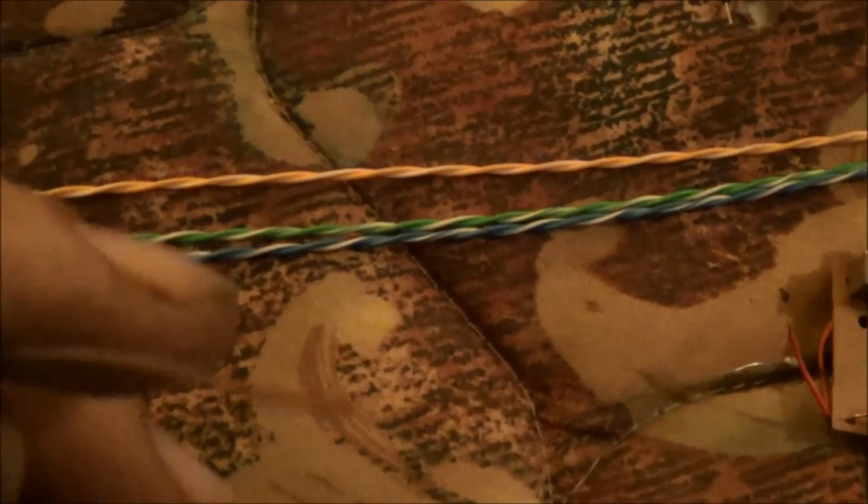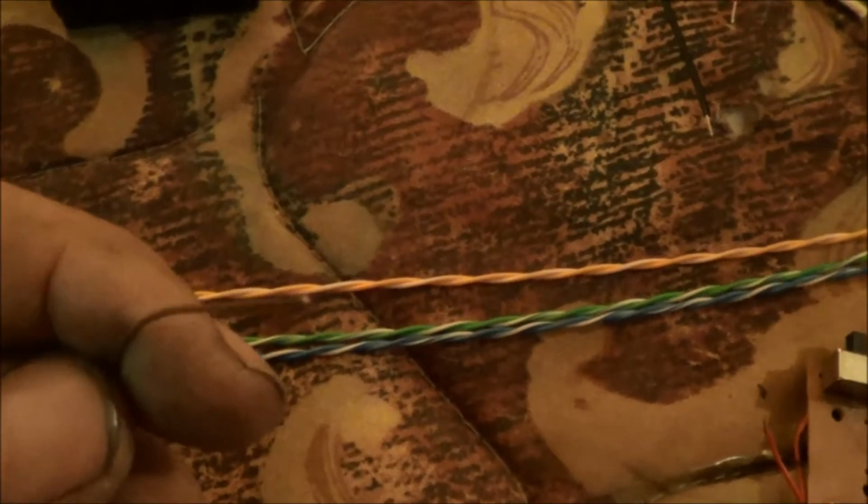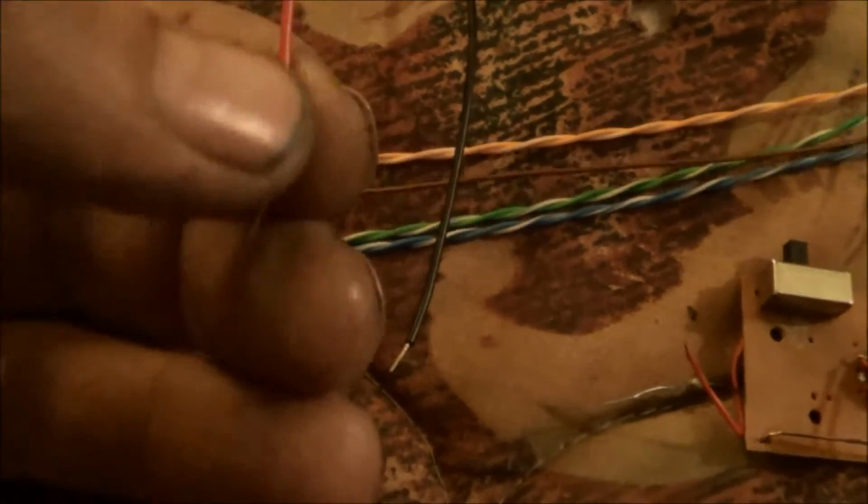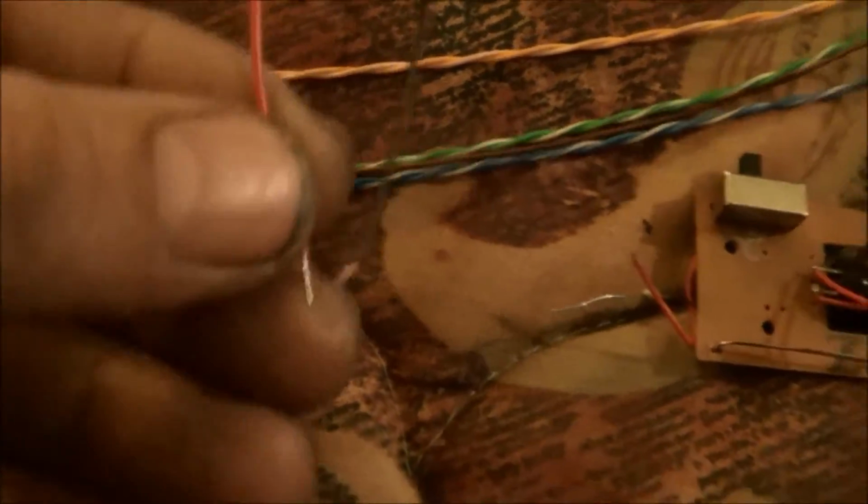This is the wire I had to get. I had to get some solid wire. This is not your stranded wire. It's just one solid wire there in the end. Yeah, and it's coated just to solder in for my jumper wires. I'm trying to use even a small stranded wire like on this battery pack. I mean, unless you tinned them first, put the solder on the wire, it would just be too difficult. It's way easier with this solid fine wire. I got this out of a piece of Ethernet cable, basically.